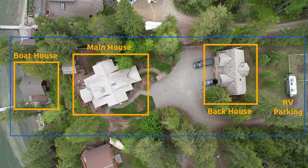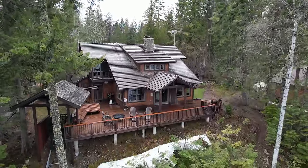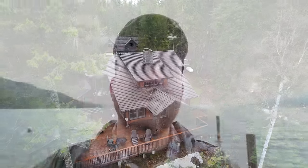Now we have our starting point and we need to figure out where we want to get to. It's an interesting setup because of the three different levels. The bottom boathouse — they want internet and good Wi-Fi down there, and it's also the best place to terminate the wireless ISP connection because it has a clear view across the lake to the access point antenna. He's also going to be putting in Starlink as a secondary internet connection. The internet he can get today is maximum 30 megabits from the wireless ISP, and Starlink is made for this type of rural location. He's on the wait list, which could be six months or a year. So in the meantime, we're going to keep the wireless ISP.